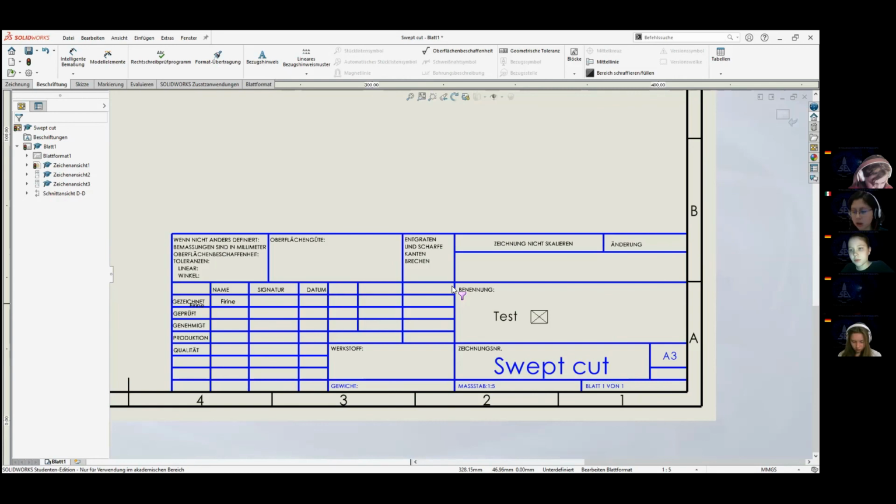So when we manufacture things and we want to assemble them, we always need to consider tolerances. Otherwise they will not work. In professional drawings, we always need to annotate which tolerance applies to which part, or sometimes we need different tolerances in the same part. This is a whole new lesson, but it's more or less what you need to know right now.